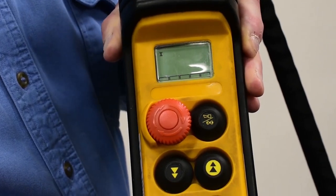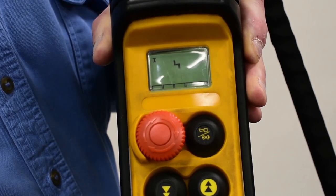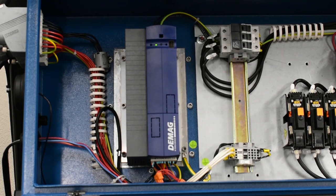So if we see error 21 or 121, one of the first things to check is on the face of the VFD, we look for the LED flashing. The green flashing LED means the VFD is not experiencing an internal fault. So if we see the green flashing LED, but yet we're getting error 121 in this case on the bridge panel, we have to suspect the interconnecting wiring between the control board and the VFD has an issue,